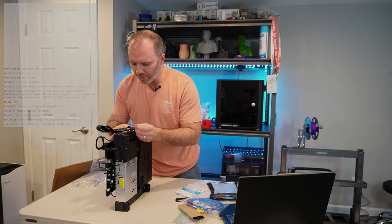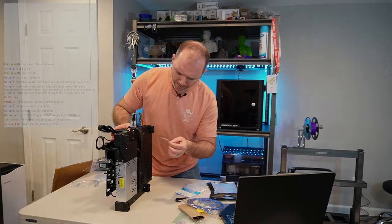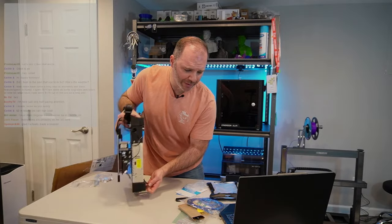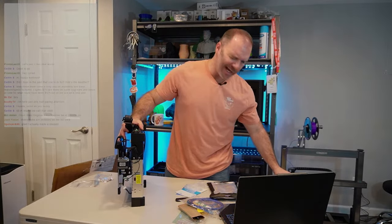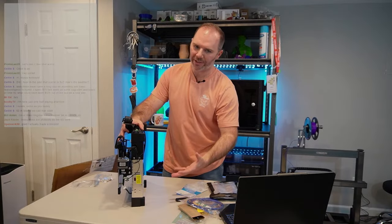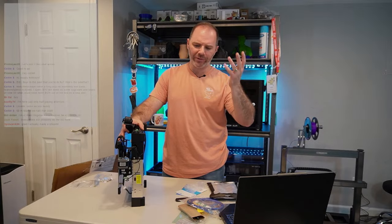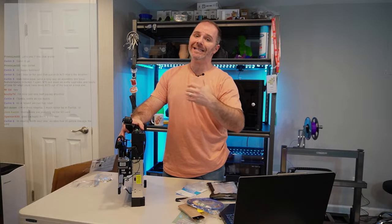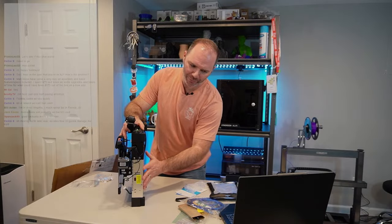Power input, okay, so it tells me to adjust the power input. Oh no, warning, power input 110. So I don't know if I have to adjust it or not, my voltage. All right, I'm already adjusted. So always make sure that the voltage is correct whenever you're setting up these printers. Obviously for me, it's not the worst. I'm 115 volts. If it was set to 230, I just wouldn't be giving it enough juice. If you are overseas, if you're in Australia, I think who had the problem recently? Krampus with his T500. If he gets the voltage wrong, that's a problem because he's sucking in 230 to a 115. That's no good. Either way, just make sure your voltage is correct, please, people.